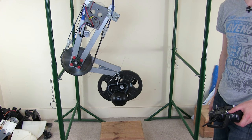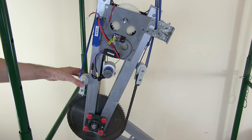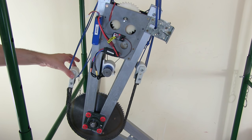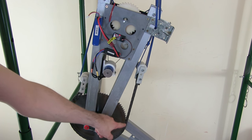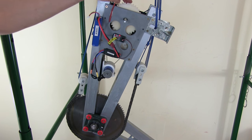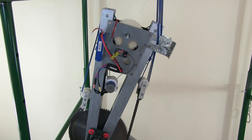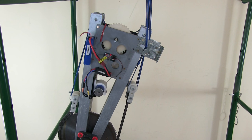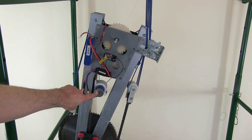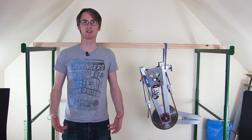All right, looks pretty good. I lowered it down a little bit more. The only thing I noticed was that the tricep cord has gone slack — so obviously there is some stretch in this cord — and all of the tension is on the front on the bicep side. So that's definitely got enough strength to lift it. All my gears are still perfectly intact. Remember that the 3D printed gearbox is not actually taking all of the load due to the blocks and tackles, which are multiplying the force by five times. And remember this is the motor driving it all — a rather small brushless RC motor. I'm pretty happy with how that's turned out — the first go of building an actual axis of the arm.